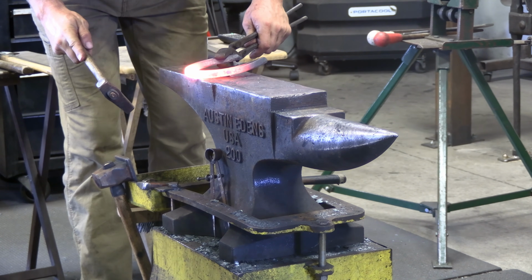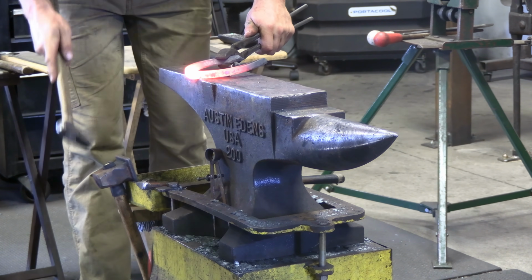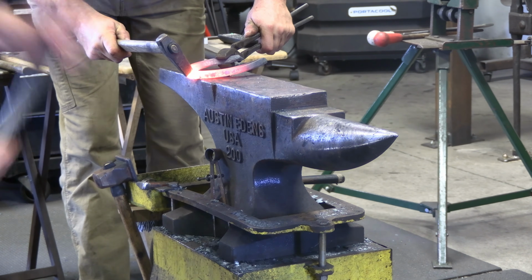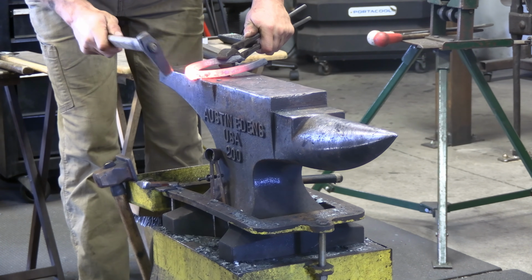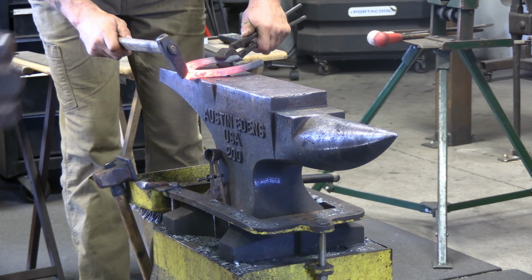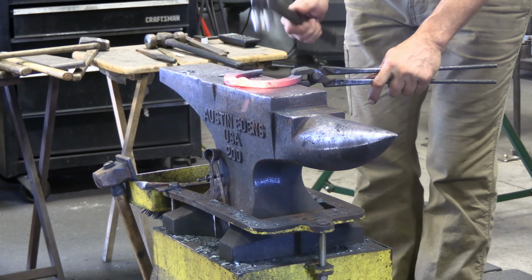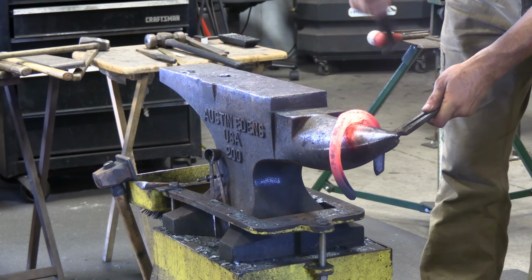Alright, when I go to pull this clip, I hang over about 5/16 of an inch. And I learned this from Shane Carter. Somebody asked him at a clinic one time what's the right amount to hang over, and he gave 5/16. And I know that's not perfect every time, but that's a good target to shoot for.